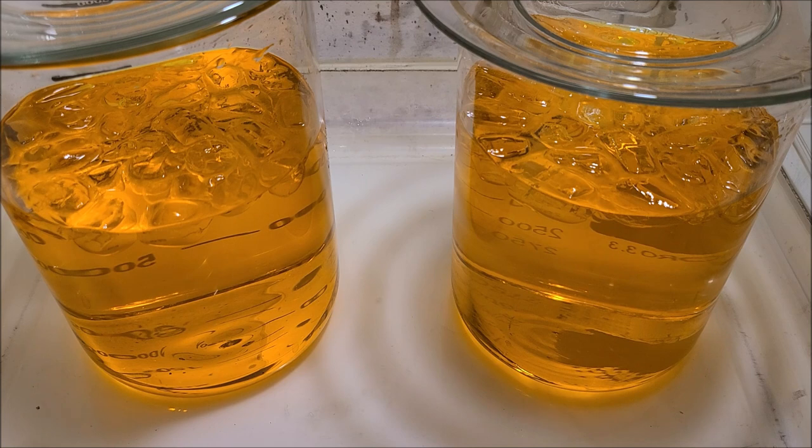It still contained traces of base metal, which made the solution turn kind of a greenish hue, mixed with this dark red that it was. Now that it's diluted, it's typical orange look, but mixed with that, it almost looks black. It's wild. So then, after that, we dropped that gold out of solution, poured off whatever base metals were still trapped in solution. We took that gold that we dropped out of solution, went through our various wash procedures. Once that was done, threw it back into the beaker, redissolved it in aqua regia, and here we are.